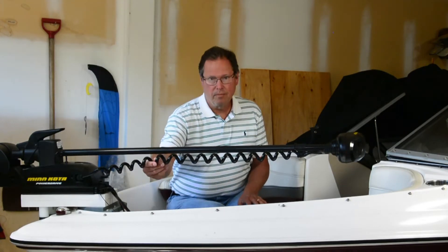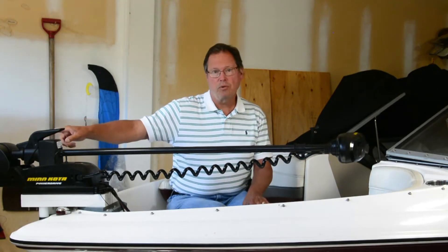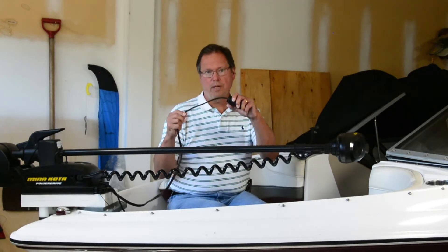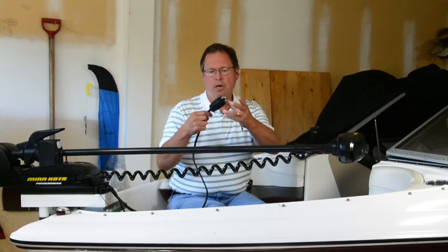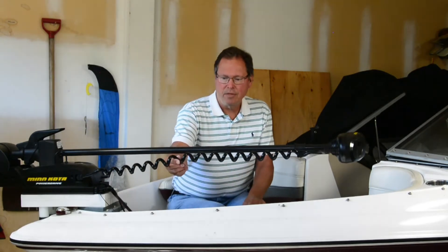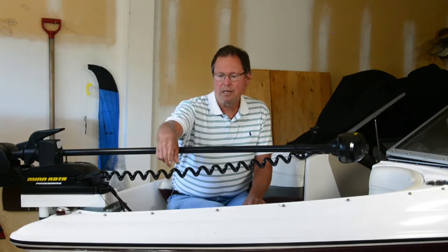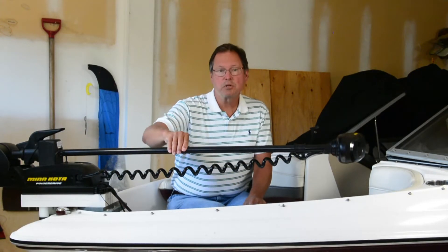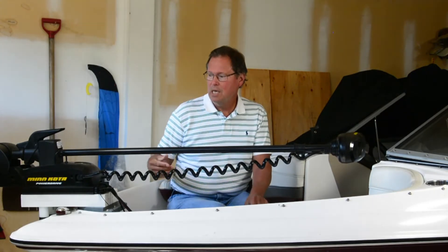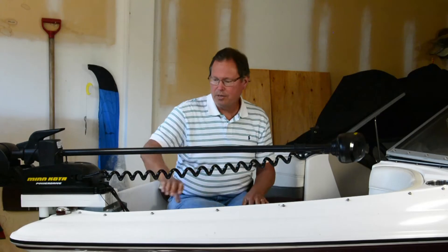The wires and the wiring used in the connection from the head to the actual motor that's under the water are 10-gauge wires. If you do the calculations on the main connection into the motor, which is relatively beefy wire, and then add the effect of 50 amps and the voltage drop on these 10-gauge wires — about seven or eight feet there, and another six feet times two for positive and negative going back to the battery — you're talking about a total voltage drop of about one volt through this entire part of your system.